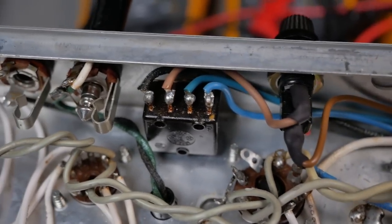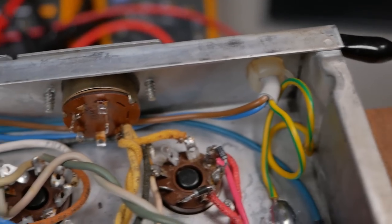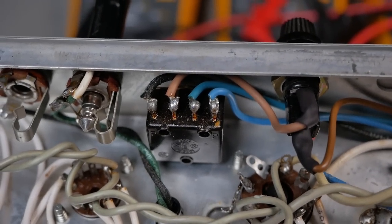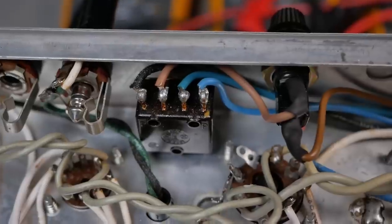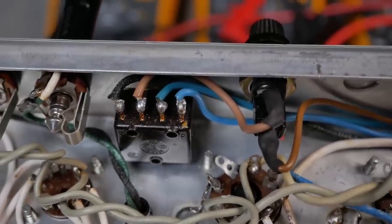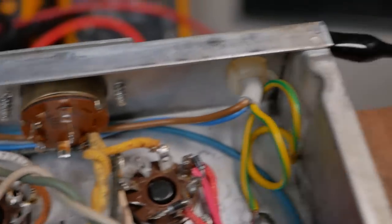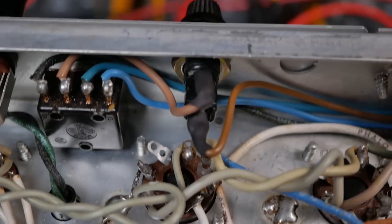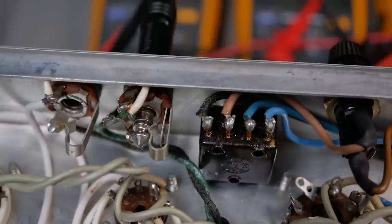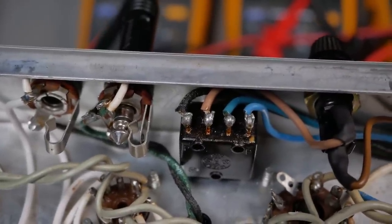Regarding the power, we've got our active coming in here. Our color codes are different to you guys in the States. Black is active, white is neutral over there. Over here, and I think in Europe, brown is active and blue is neutral. So it comes straight in the cord there with the retainer to the fuse tip, and then from the fuse ring to the switch, and that goes to the active input of the primary, the power transformer,